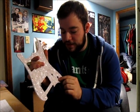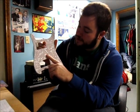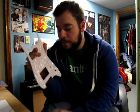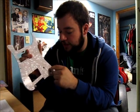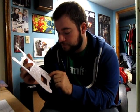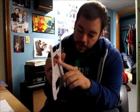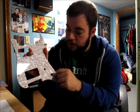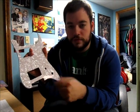With everything like this, basically what I would have to do is wire these pickups all the way down to here, then back up to here, and then back down to the input jack — and it really doesn't make a lot of sense to do that. By having the toggle here, I'd actually move it over slightly. And I think if I do the volume here, I'm actually going to move it down a little further, kind of like where the second tone knob would be in a normal Strat. So by doing that, they'll both go to here, but the pickups will still have the ground over here with the volume, and then from the volume it would just go straight to the input jack.